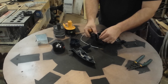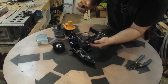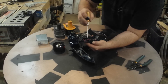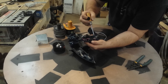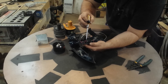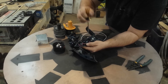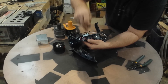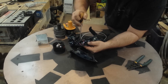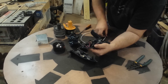I'm going to pop this part and pull that guy out. Now inside we've got our negative and our positive. Because I want the power flowing through the negative to go through the light and then come back, and I also want to keep the use of the switch there, I'm actually going to come between right here and right here.